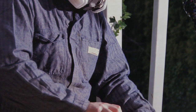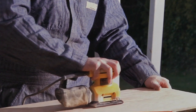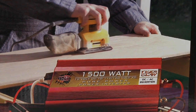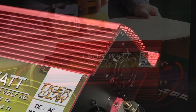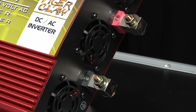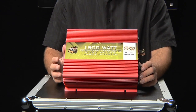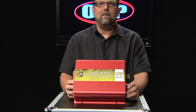The pure sine wave inverters will reliably power devices that normally won't work with modified sine wave inverters. Such devices would include laser printers and photocopiers, certain laptop computers, some fluorescent lights that have electronic ballasts, power tools that employ solid state power or variable speed control, battery chargers for cordless tools, some furnaces and pellet stoves that have microprocessor control. Other types of devices that have variable speed motors or use microprocessing control will require a pure sine wave inverter.